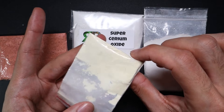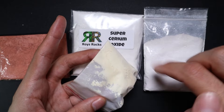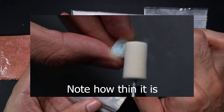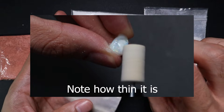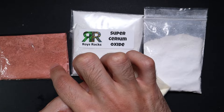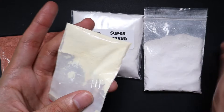I'd prefer to go for a super cerium, which is less than two micron — a lot of the time one micron or less. For all of these finer ones I say run as wet as possible for the entire time, no dry running. You can do a little dry towards the end if you're just trying to clean out your burr. The water actually helps with the chemical action of this material. Whereas the optical grade, because I want to grind it up a little bit, you run it with less water and use more of the abrasive properties — with hardness around six, it works quite well.